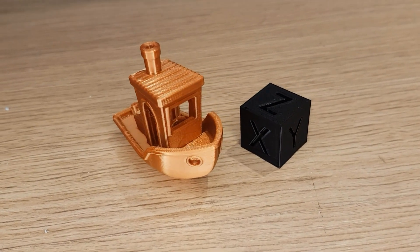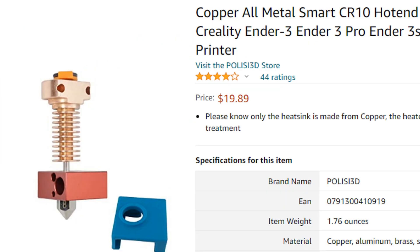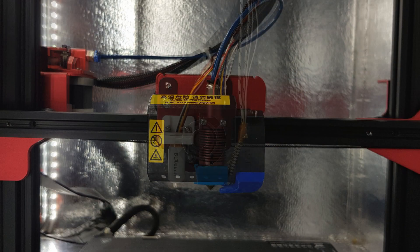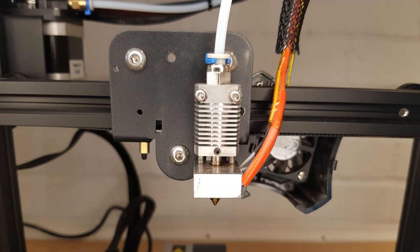After seeing the first few prints with this hotend I'm going to tentatively call this change a success. With some basic knowledge of how the hotend works I've been able to fit a hotend designed for a different printer to my CR10S Pro and have it work pretty faultlessly straight away. This hotend change only cost me £20 and in the US it's only $20. I'll put links in the description to the hotend and free download links to all of the files I used. I can't give any endorsement to the long-term performance as I haven't been using it very long, and some Amazon reviews have said it's a little delicate and easy to twist the heat break out of the heatsink, but I haven't had any problems. If I do have issues with the heat break twisting, the next thing I'll try is a standard Ender 3 hotend — so watch this space.